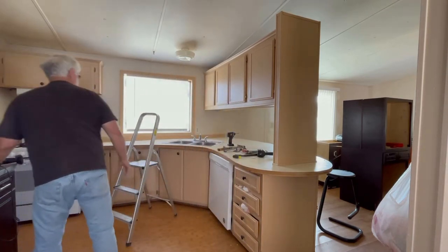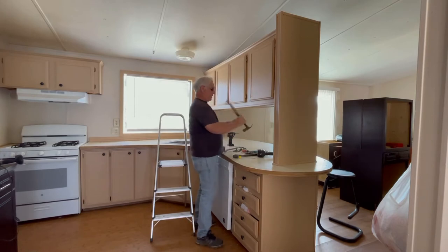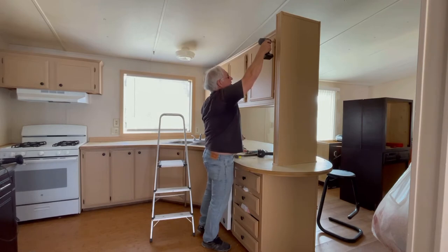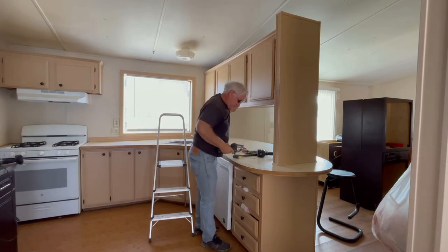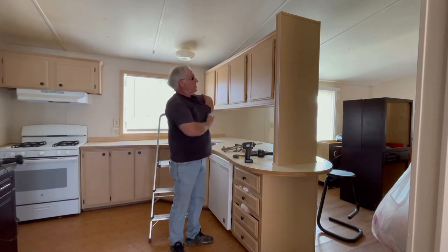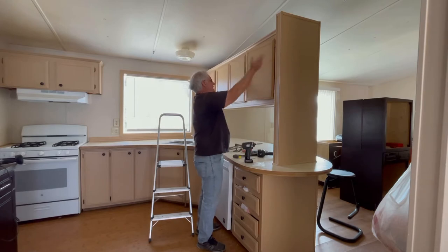Okay, I'll start with the uppers. These doors — I'm going to take them off. A lot of times I'll just rip them off; you can get behind the hinge and rip them off. But because these are all clean and new and salvageable, I'm going to take them off properly. Whenever you're removing doors, there are four screws in these hinges. I have a little bag here so I can save the screws — this is if you want to salvage or bring stuff to Habitat for Humanity. Always take the bottom screw off first so the door doesn't slop down.